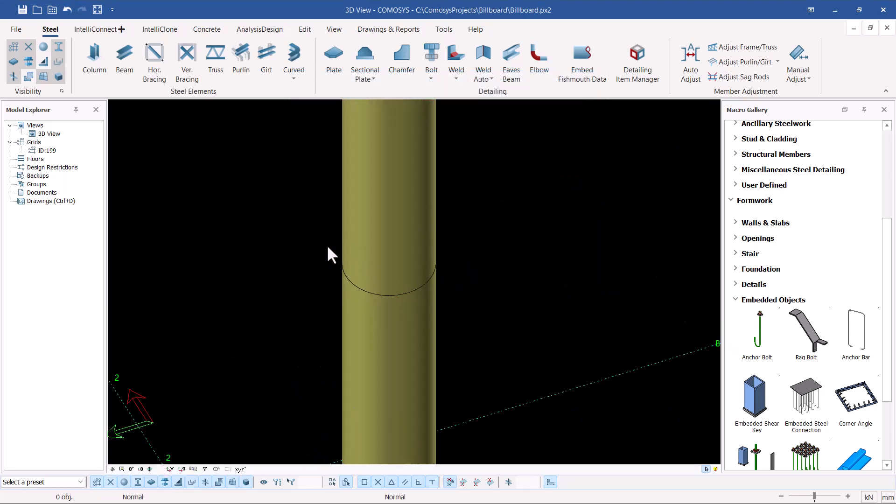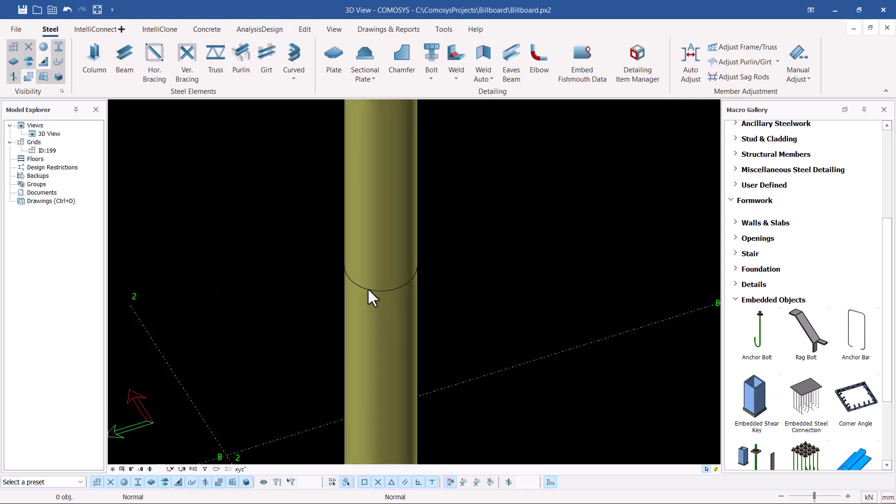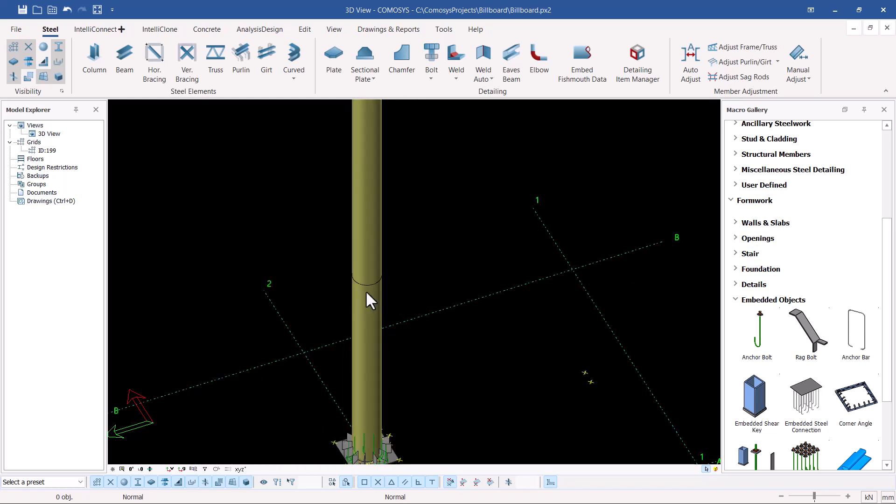There's a connection here. Some people prefer welding, but this is a very long length of steel that would be very difficult to transport to site — unless you're doing your welding on site, which would also be very difficult. It's always better to chop these into sizable segments that are transportable, and you can use a cheap crane to lift these components during installation.